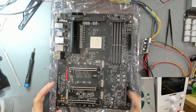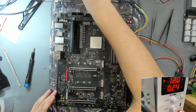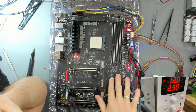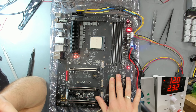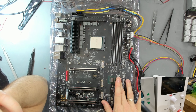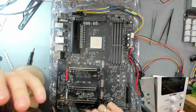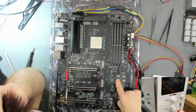We have reaction to the power button and the PCH is getting warm. I think the PCH might actually be dead because it's getting very, very hot very quickly. The big problem right now is we don't have the ITE chip on here, which might be responsible for starting up. We might need to get the chip from the other board, put it on here, and see if that makes a difference. We already have high power consumption because of the PCH being attached.